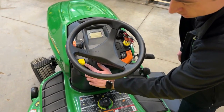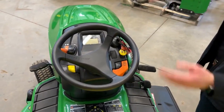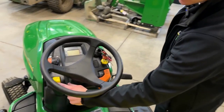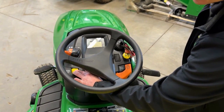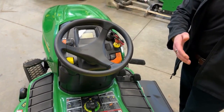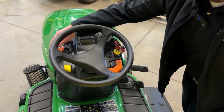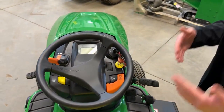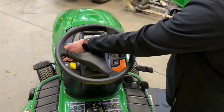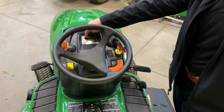This button here is the override button to allow you to mow backwards. Say you're going into a specific path and either you miss something or you need to get into a specific area by backing up — all you do is hit your reverse override button, hit your reverse pedal, and it'll lock in so you can start backing up with the mower deck on. If you don't do that it would stall out your machine. Up here is your throttle. When starting the machine it's easier to keep it at a low throttle, then as you're turning your deck on you're going to want to throw the throttle up. There's an RPM rating right here telling you where your throttle is set.